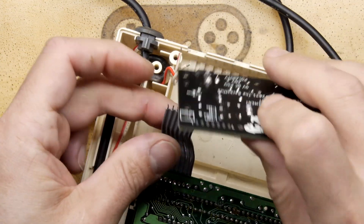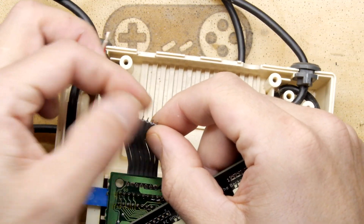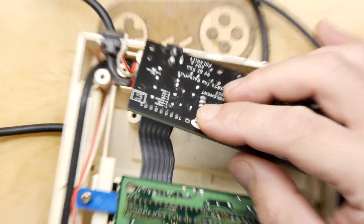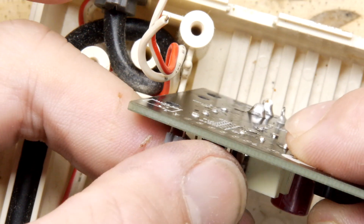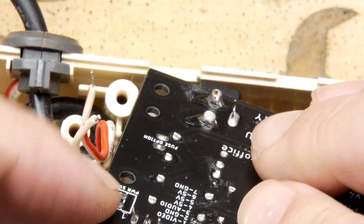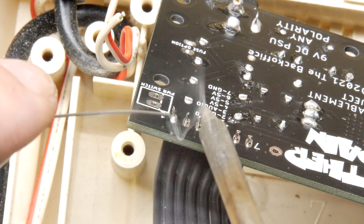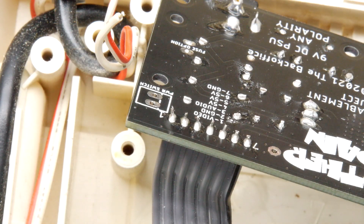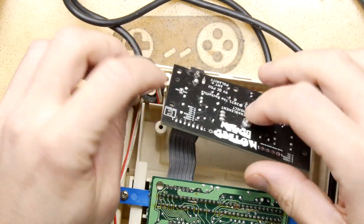Clean up those pins and make sure they're nice and clean, because getting the alignment right matters — you've got to poke all seven through at once. Don't solder them in one at a time; push them all through, check they're all sitting flush to the edge of the ribbon, and then just go in with a little dash of solder. Don't go brutal — if everything's clean it just flows. If you're putting a lot of effort in, back up because something is going wrong.